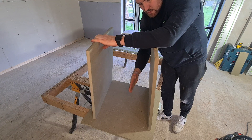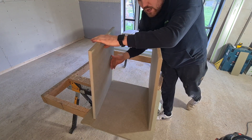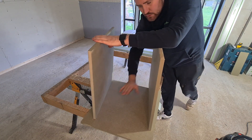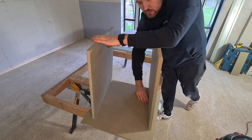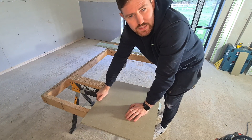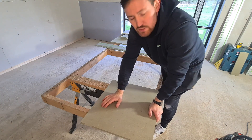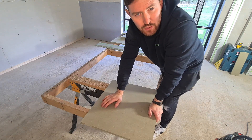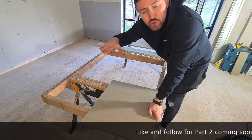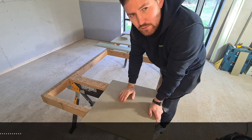If you put the top on top of that then you're 18mm different, so we need to work out the complete width we wanted — which was 1066mm — minus two lots of 18mm, which gives us the space we want in between. So 1066 minus 36mm (which is two of the 18mm side panels each) comes to 1030mm. So the back of our unit, the bottom of our unit, and the top rail are all going to be 1030mm long.